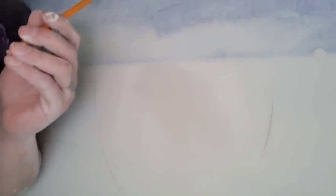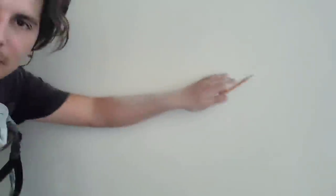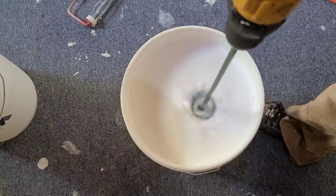Now let's move on to number two, which is still a little wet as you can see, but once that dries, it's gonna blend in perfectly with the rest of it. So what happened here is I sanded a little bit too far down. You wanna really feather out the edges of your flats and butts, and when you do so, sometimes you sand a little bit too deep and you expose the tape. So as I was trying to blend this into the rest of the wall so it would have a nice transition, some of the tape peeked through. That usually doesn't happen because it sits in a bevel on the flats. It'll more so happen on the butts because there is no factory bevel, but in my case, I just screwed up. So marked it, I have to do a little touch up and then I'm ready to prime.